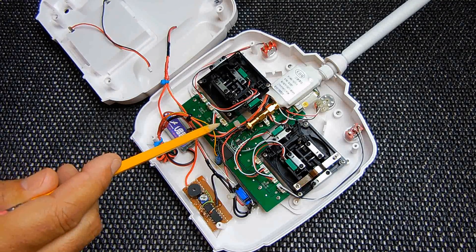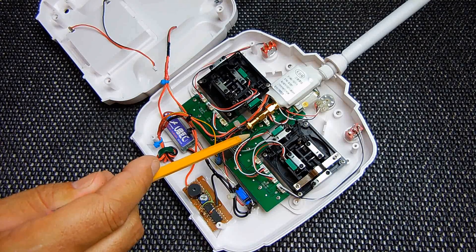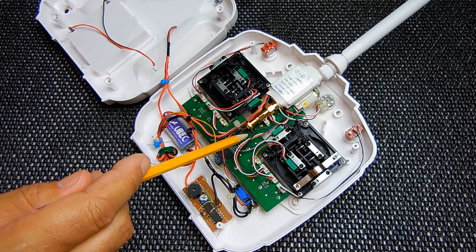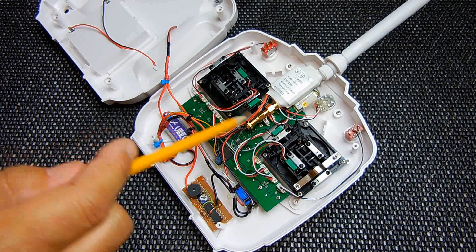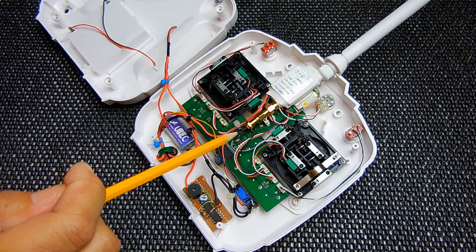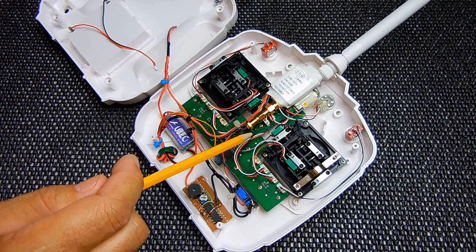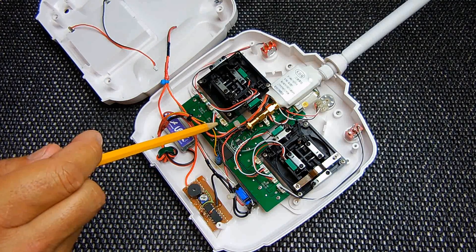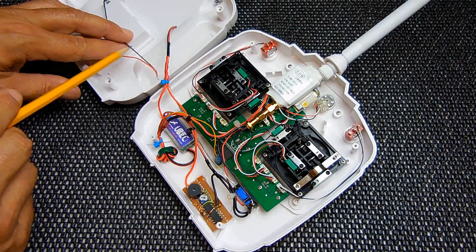You have your two wires connected to the board. Over here is the switch. Take the battery positive — which is on the right when you plug it in — trace it and it goes to the second pin up right here. Take your digital multimeter, put it on a DC voltage range of 12 volts or more, connect the black probe to battery negative, and probe the pins on the switch. Find out which one shows approximately 6 volts when the switch is in the on position. Once you find that pin, solder a 20 to 24 gauge wire directly to it and route that to the relay coil. The other side of the relay coil goes to battery negative — you can find the spot on the board connected to the left pin, or tap-splice into the black wire and heat shrink it.